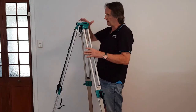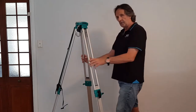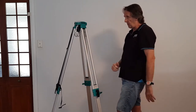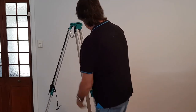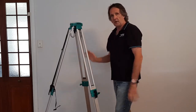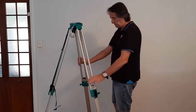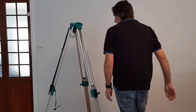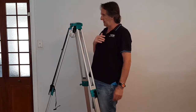What I'm trying to do at this point is get that dome head as level as possible. I'm going to view it from where I'm standing, looking at it in a horizontal plane, and then move to the side 90 degrees. I can see that front leg needs to go down a bit further to get it level in the other horizontal plane. Once I've got it to that point, I put some light pressure on each of the foot pegs — that stops the tripod legs spreading out. I've pretty much got that dome head level and I'm happy with that.